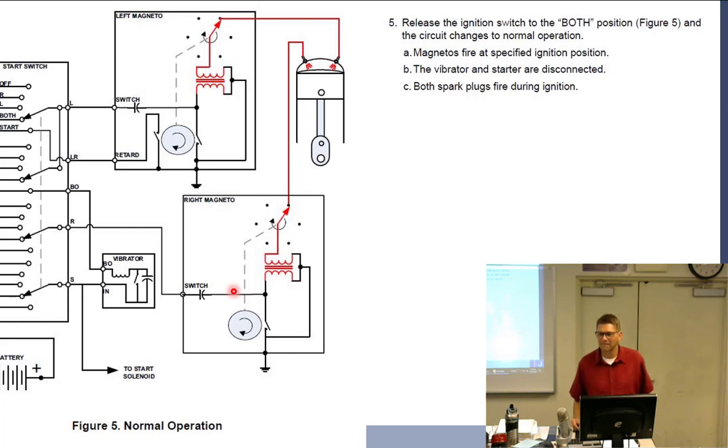I'm just trying to think of the difference between... Well, I guess it's at a slow RPM. The best way that I could do this is if I took you over to the lab and we put a spark plug in the spark plug tester, which uses the same thing to test the spark plugs. You put it in the spark plug machine, you add that compressed air, you push a red button, and it sparks. It's just a continuous spark.